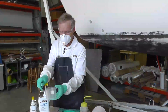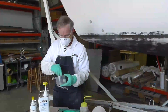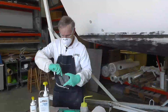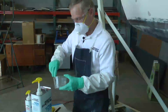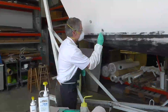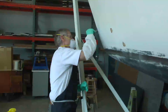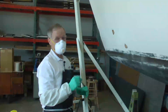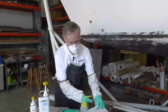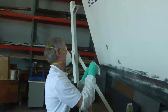We're going to mix up a small batch of epoxy now — just one pump resin, one pump hardener. We're going to stir it up real well, and then we're going to brush a very thin coat of epoxy on each of those places to kind of prime these areas. If we don't do that, thickened epoxy may not want to cling to that surface very well. We just need a very little bit of epoxy on each of these spots — we don't want a real heavy coat because it'll act like a lubricant for the thickened epoxy. You have two options: you can wait and allow that to cure to the point where it's tacky like fly paper, which might be an hour, or you can take some paper towel and wipe the excess off, because we don't need much on there — that way our fairing won't slide off.